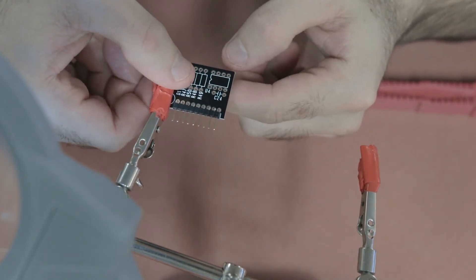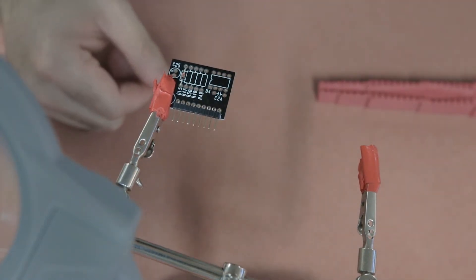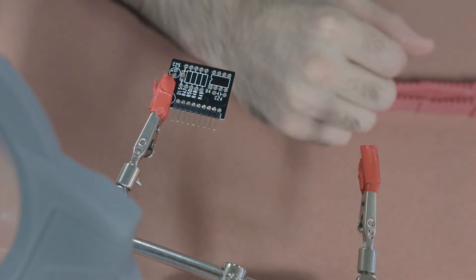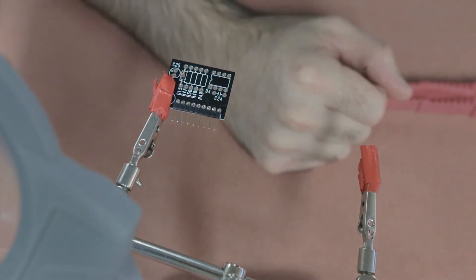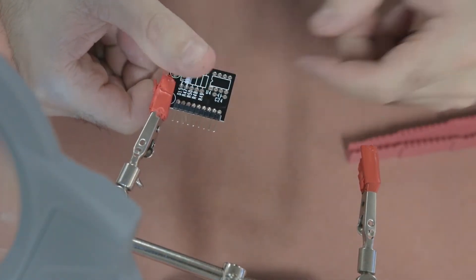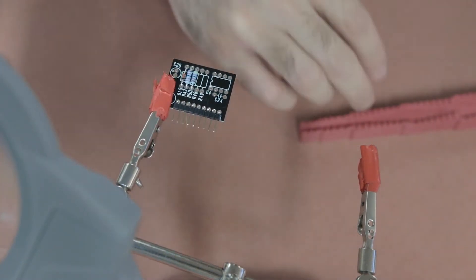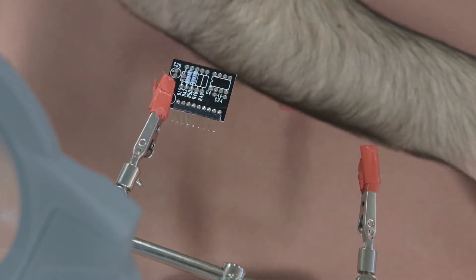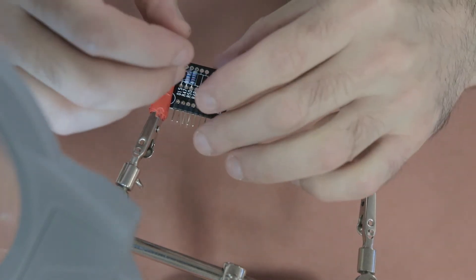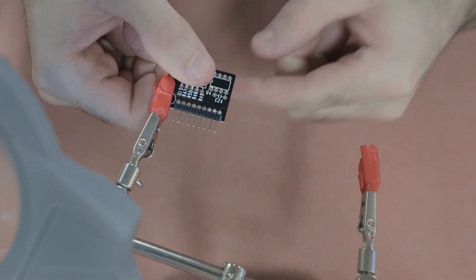The first component is a diode, and like with all diodes you want to make sure you orientate it correctly, with that black line matching up with the little line on the PCB. Then there's a bunch of resistors to place on the board — quite simple, just make sure you're checking the values before placing them. With all of these components, it's great to use that forming tool once again as it makes inserting them into the board nice and easy.